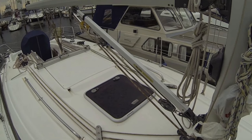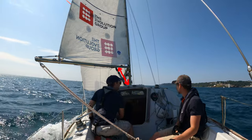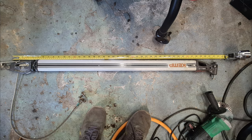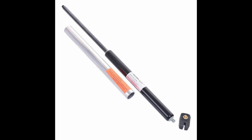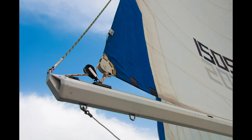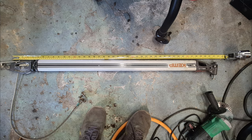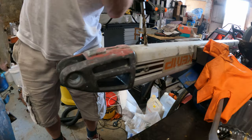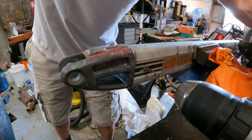So what is a rigid Vang and why have I taken mine off? Rigid Vangs aren't really rigid as such — they extend and contract to allow the boom to go up and down. The Selden Rod Kicker, which is what my Vang is, has got a hydraulic strut in it — a bit like the hydraulic rams on the boot of your car that push it open. The advantage over soft Vangs is that you don't need a topping lift. If you're reefing at sea, you can literally undo your main halyard, drop the sail, and you don't need to worry about the boom clattering around on the cockpit roof. When I took mine off, I noticed it didn't move anymore — it was kind of frozen solid. You could get it to extend but it wouldn't compress past a certain point. So I took it home and this is what I did.